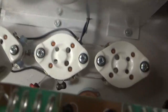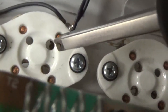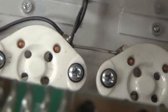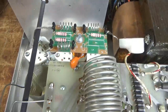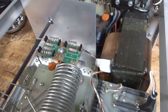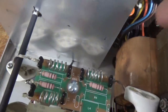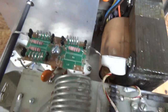One of the sockets has an issue. I must have put the tube in at an angle or something, because the clips are pushed down. I'm going to have to replace that middle socket; the other ones look okay. The SO239s still look okay from Max Gain Systems. So once I get the socket fixed, I don't see anything obvious. I'll plug in a brand new set of tubes and try it.